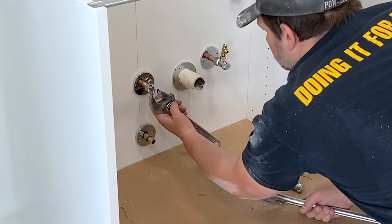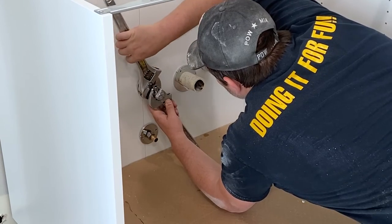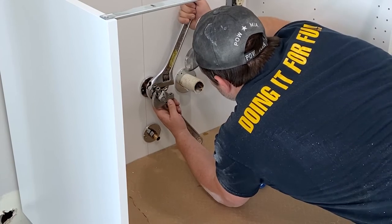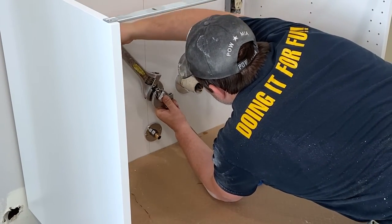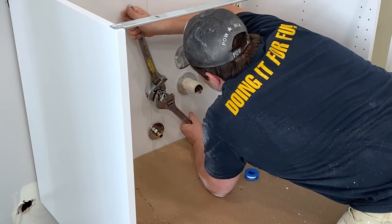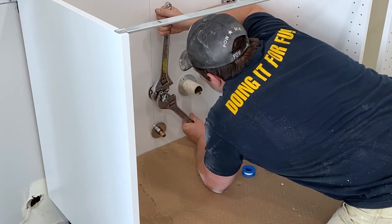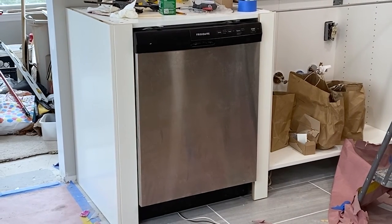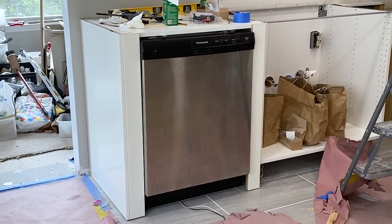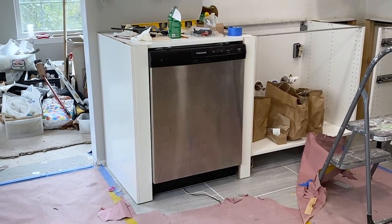Repeat the same steps on the next valve — I'll leave you with this final max tip: depending on the size of the sink cabinet, it could be a tight space to work in, so always make sure you get all the under-sink valve work done before the countertops arrive and you have a sink hanging over your head while you're trying to work. Also, don't rush to put the doors on if you need to install a food processor or dishwasher after the counters are installed. In the next video, we'll share our ideas for a unique dishwasher enclosure that carries the load of the counters at the end of the base cabinets — it looks pretty standard on the outside, but you'll be surprised by the creative assembly behind the cover panels.